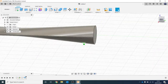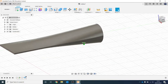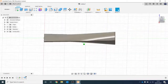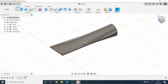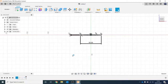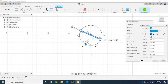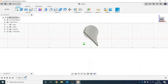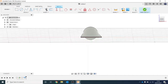So already we've got a tube-like shape that we want. Looking at this shape, it's not complex, but you couldn't really have created it by doing a sketch and extruding it, and you couldn't really have revolved anything either. Any unusual kind of shape, Loft is normally the way to go, and you can go back and change those profiles. For example, if I go on Edit Sketch and rotate it, you'll see that it will rotate and make it a little more unusual. So there are lots of things you can play around with when lofting.